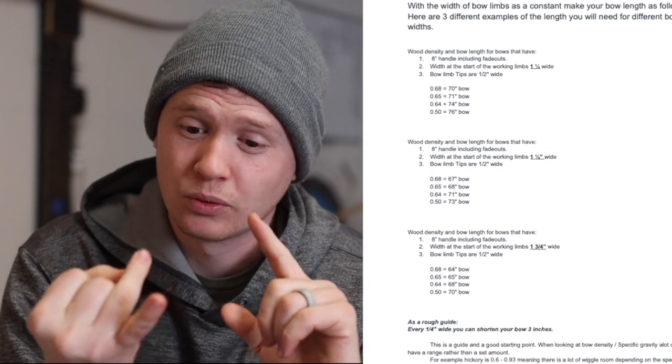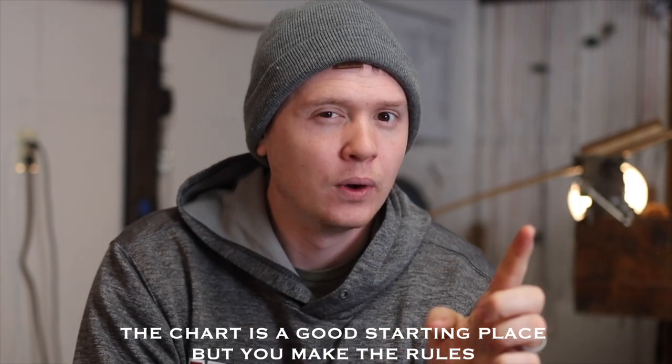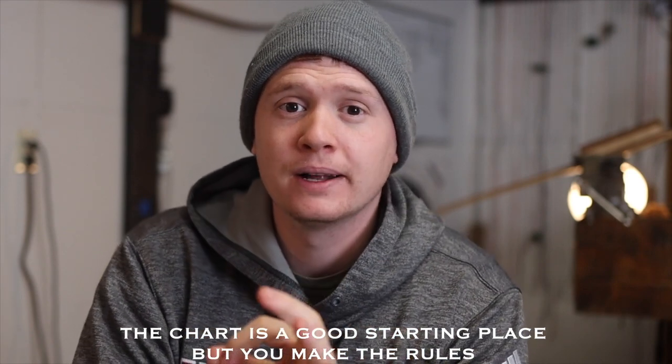I did it for three widths: one and a quarter inch, one and a half inch, and one and three quarters of an inch. So if you're going to make a bow, it doesn't matter what wood — if you look at this chart and then search online for a wood density chart, you can know the exact width and length of bow you're going to make before you even start, based upon the specific wood density you're using. One more thing: wood density varies depending on the species. There are different kinds of maple, and one kind can be more dense than another. A lot of charts will give you a range, and with hickory for example, you may need to experiment a little within that range.